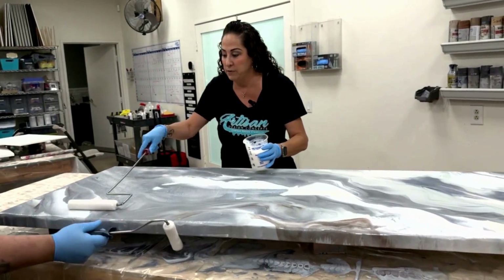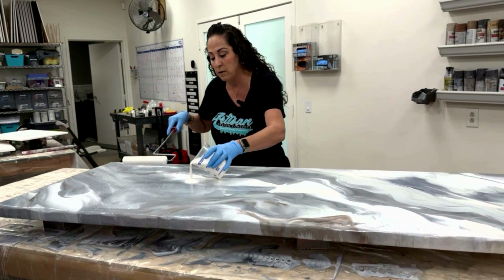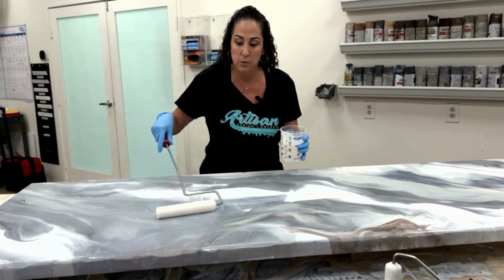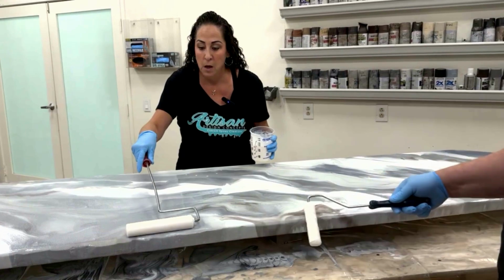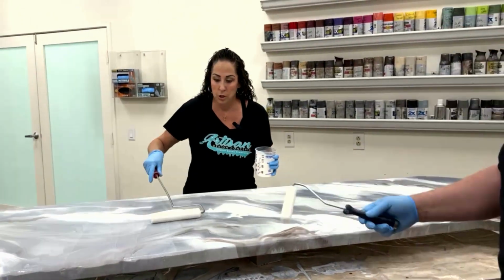Now, in previous videos, you might have seen me do a dip and roll. And we found that with some practice, this was the best option. It gave me better control of how much material was going on and just generally worked better. We are using 3/8 inch nap rollers, 6 inch.